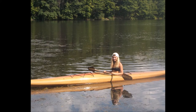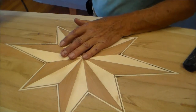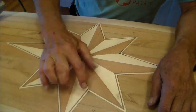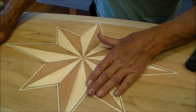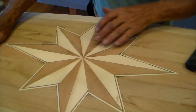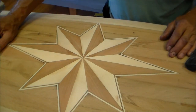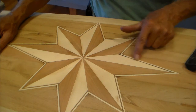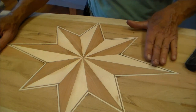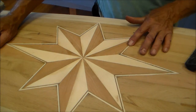Hello, my friends. I'm going to share some tips and techniques on sanding the compass star kayak. When you're sanding, there are areas you have to pay particular attention to — specifically where there is glue over the wood. You want to make sure you remove the glue from the wood, or it's going to leave a ghost image and you'll be disappointed in the finish. If you need to make a filler to fill in some grooves, use epoxy resin with sanding dust. If you use glue with sanding dust, it won't give you a good color match — it will block the finish from penetrating into the wood, and if you smear that mix over the edges of the wood it's going to give that ghost image.